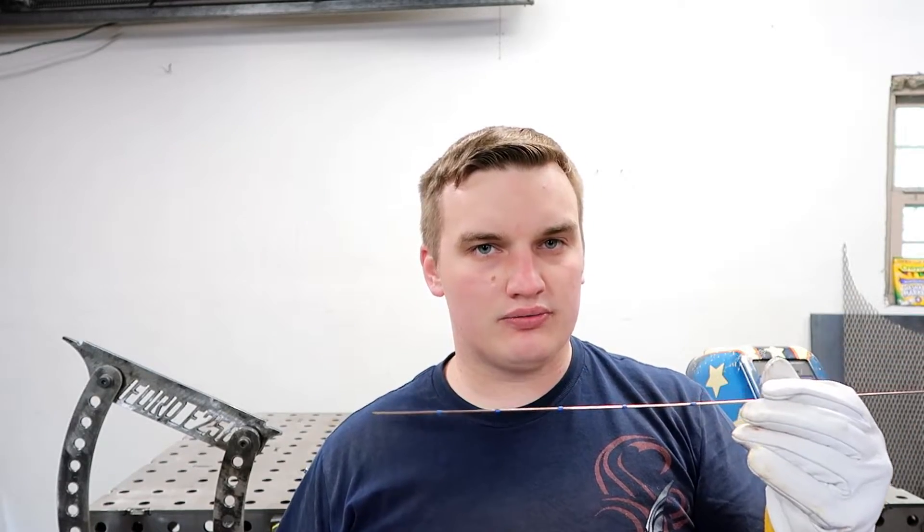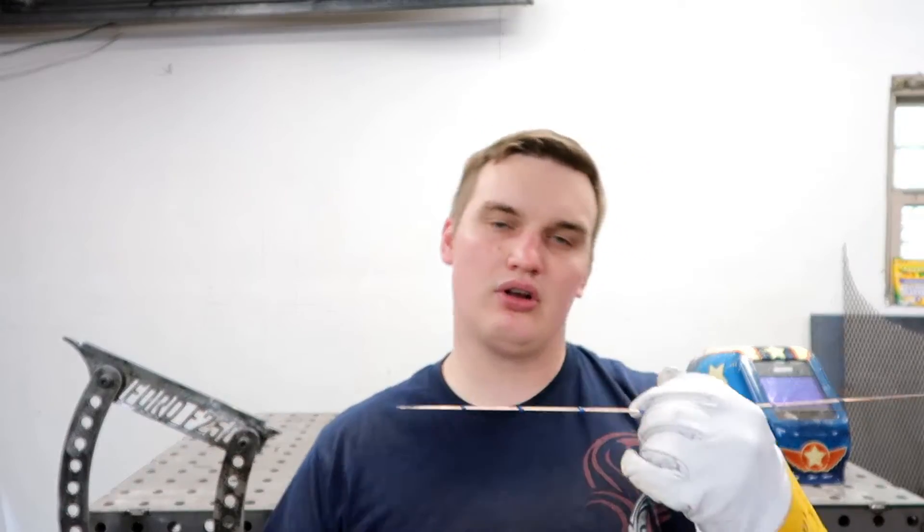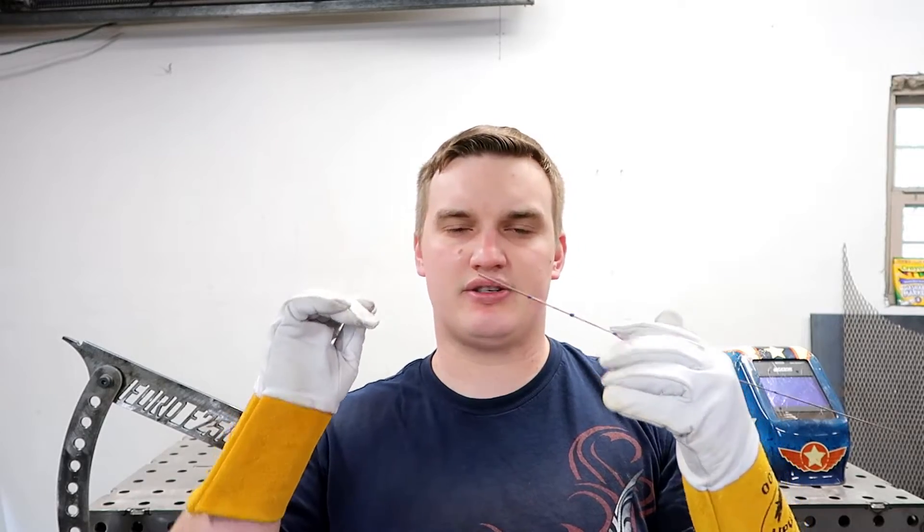I highly recommend that when you're learning to feed your rod, you use one of the last three methods. If you're just getting started out and the fixed hold is all you can do, don't let it stop you — but learning the other methods is going to save you so much down the road in getting good quality welds. I know I pushed back on it from the beginning too, and I regret it. To practice: get yourself a chunk of rod. If you go out for a walk, if you are watching television sitting on your couch, get your glove on and just sit there and feed it through, retract it, feed it through, retract it. Practice getting that dexterity down so that it becomes a habit, becomes instinctive — get to the point where you're having a conversation and feeding this rod through without even having to think about it.